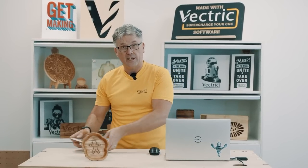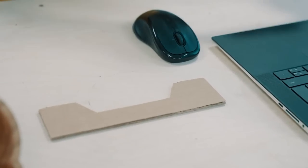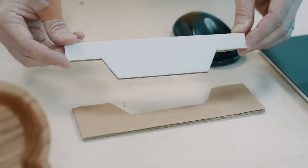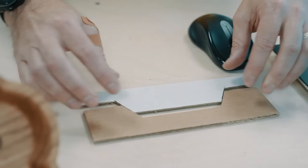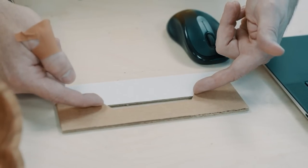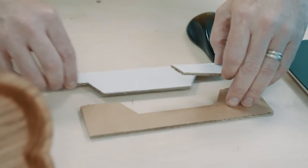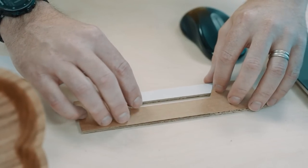Well, we're going to need to go ahead and employ the VCarve inlay technique, which is the same sort of idea. It's taking a pocket, but using your VCarve bits, so you take into account the geometry on the sidewalls of your pocket. You're going to create a plug using the same V-bit, and we can go ahead and glue that plug inside the pocket, and you'll see that because of the way we do this in the software, the face of the plug is slightly wider, so it ends up fetching up on the inside edges of your pocket. And then we can go ahead and surface the top of that, and when we're all done, what we end up with is a nice inlay that looks seamless.